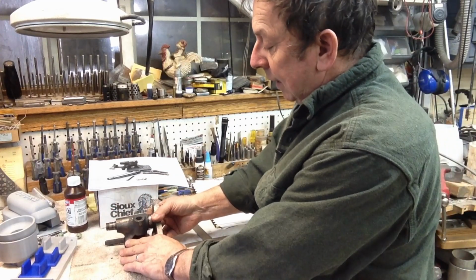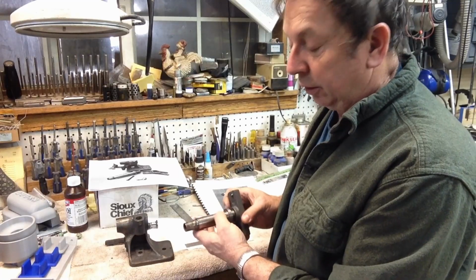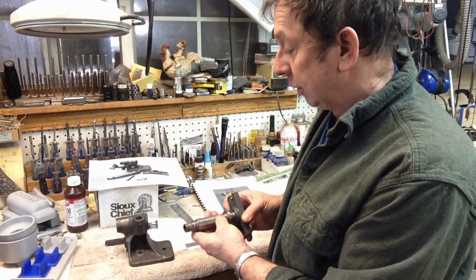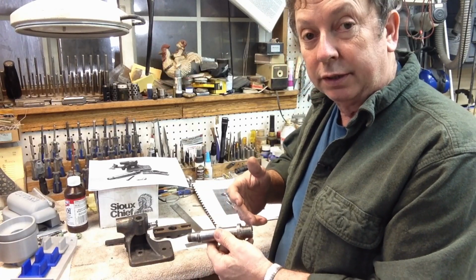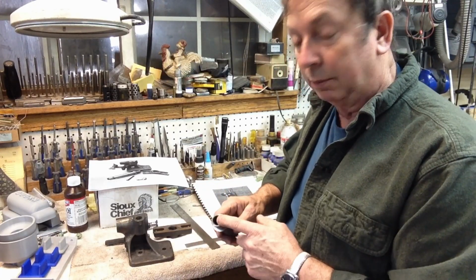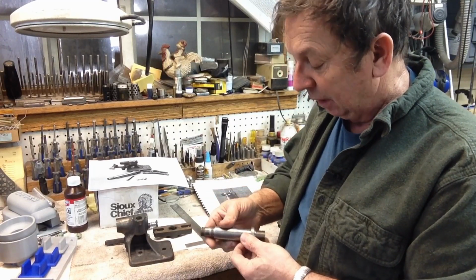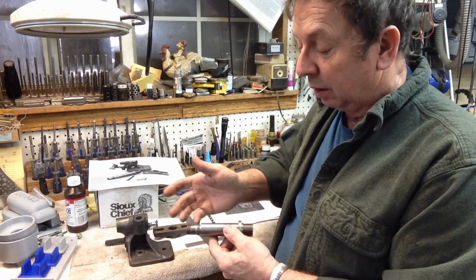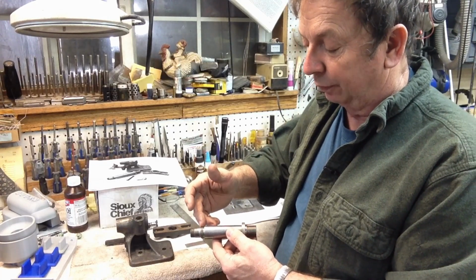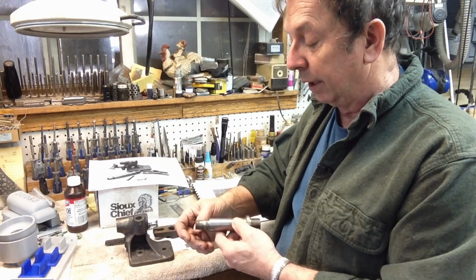When I got this, what I got was this ragged spindle that's in it, but when you look at the drawings from some of the Atlas 6-inch stuff, of course we have the same 1 in 10 threads on the spindle nose. We have a number 2 Morse taper, which is common to the 6-inch lathe, and we've got the same shoulder. These dimensions up here appear to be the same. Now where you run into differences is where we've threaded at the back for a locking collar to set our end play.